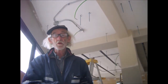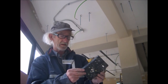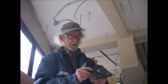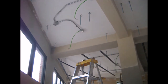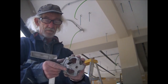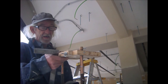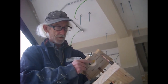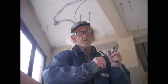These are my results, and in my opinion, as the hard disk drive has a bigger surface in contact with the ceiling, it is more stable and controls the drill bit much better than the other models. The surface of the motor parts is small, flimsy, and difficult to hold steady. The hammer drill moves a lot and makes it difficult to handle. And this one, as it's made of wood and is not precision made, loses its position quite easily. However, this is also a good option. Better than using the hammer drill only with one's hands.